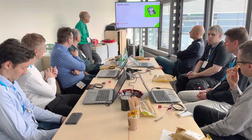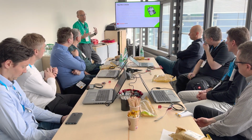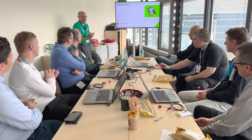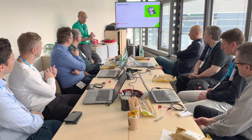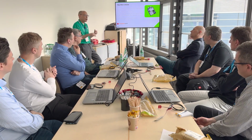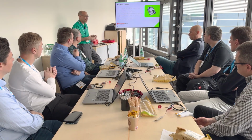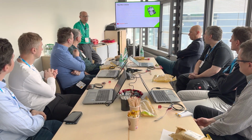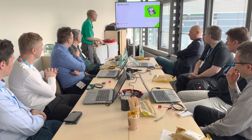It is just recommended. And all of this is packaged together with a suite of security features that we call Digi Trust Fence. And Digi Trust Fence includes everything from SSL, TLS communications to secure boot to a special chip inside the XBee Cellular that's just for encryption, so you can securely store certificates, that sort of thing, so your AWS certificate has a place to live where even if someone gets in there with debugging tools and lifts the chip, they're not going to be able to get into that chip itself. It's an extremely secure area. So all these things together, we like to think of security as a suite. It's not just one feature or another that are included.